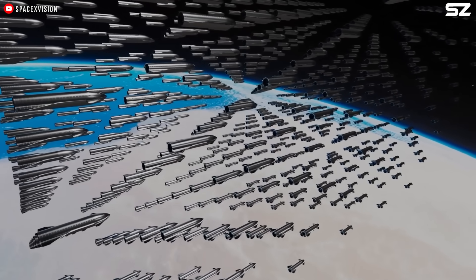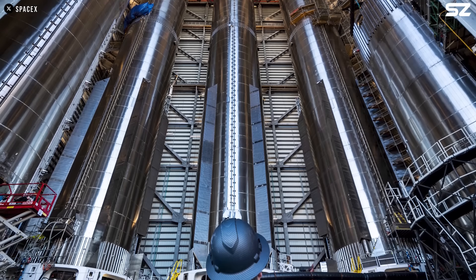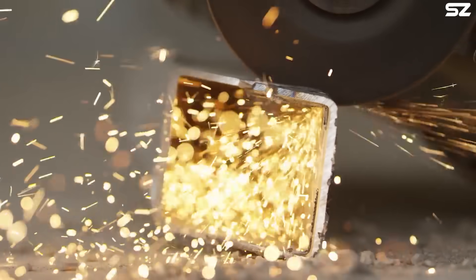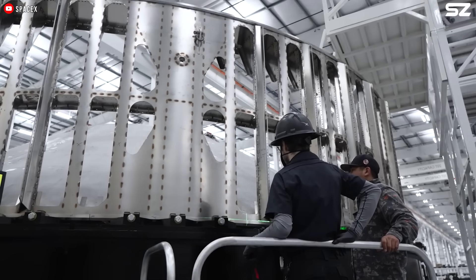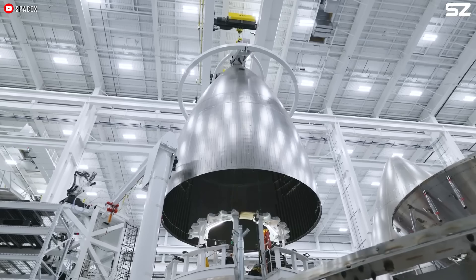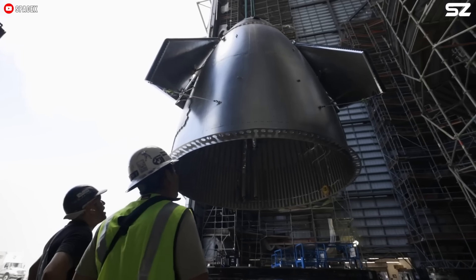Elon's vision of mass-producing thousands of Starships justifies implementing an on-site rolling mill that would produce continuous sheets with optimal width, eliminating the need for rolls and scalps, feeding directly into a continuous spiral welder. A flying cut-off system could produce sections precisely tailored in length. This on-site rolling process would also allow precise control over material thickness, enabling variable wall thicknesses including tapered sections, and by adjusting sheet width, it would be possible to create smooth transitions between cylinders of different diameters and produce bullet-nose designs.